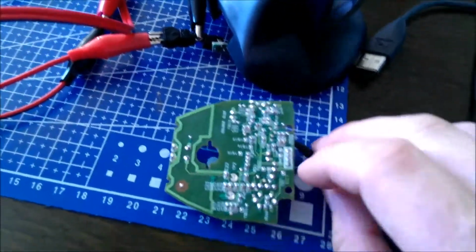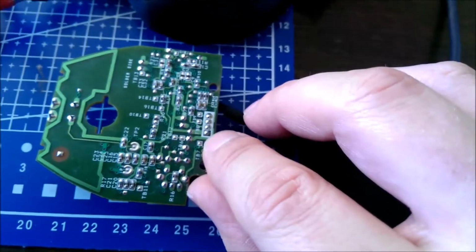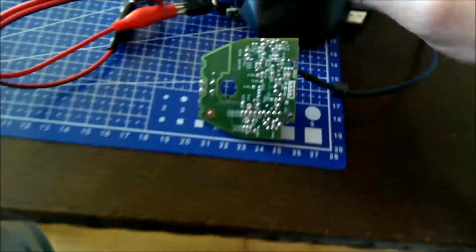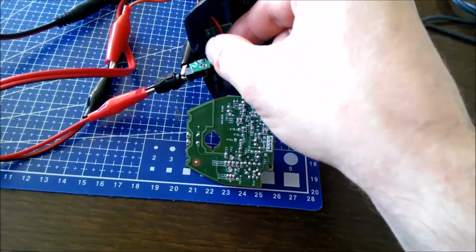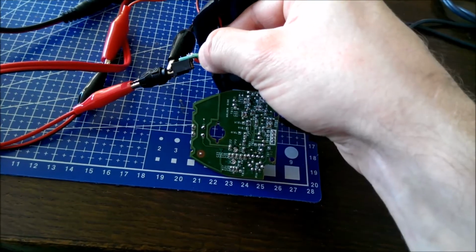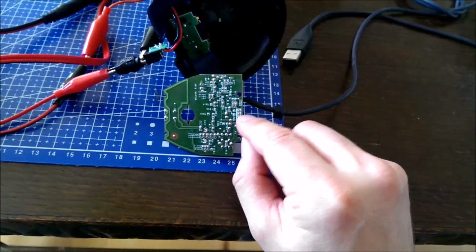If I turn it over, you can see soldering without the white background is ground, and the one next to it is the V5. So all I'm gonna do is desolder this little print board and solder those 2 points to this, and that should be it.